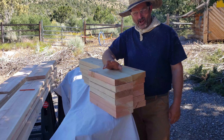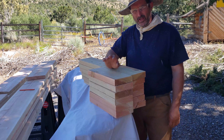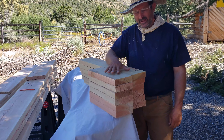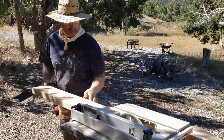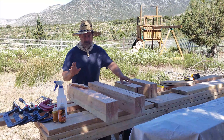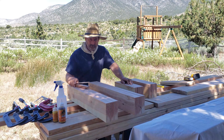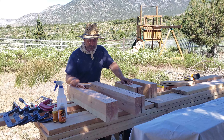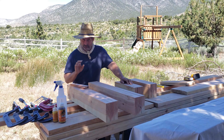This is all the stock for the four posts. Unlike the other wood which I want to be more dry and more stable before I mill it, this is much more forgiving because it's going to be laminated up. Next I'm going to finish rough milling them and set them in the clamps. Gluing up stock is always a stressful time for a woodworker - if you want to see one get cranky, wait till he's gluing up and then start asking him questions. Take the time to prepare everything before you get started because once that glue goes on the wood the timer is started.